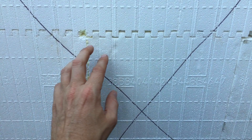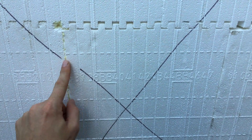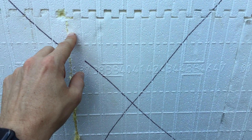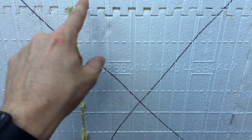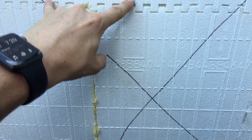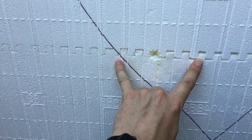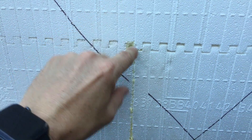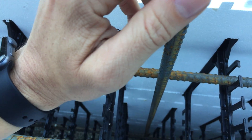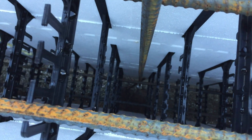Super easy fix. I would recommend: if you're going to use glue and short pieces, put your block in, glue it, then put a block on top — even if it's just a temporary chunk to span the area — because that'll keep the teeth lined up while the glue dries, and then you'll be good to go.